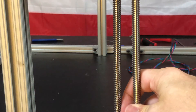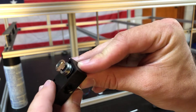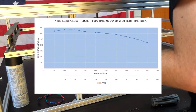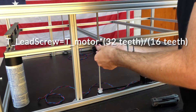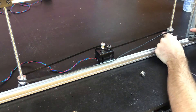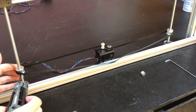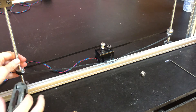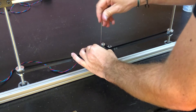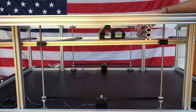I got these replacement lead screws which have a 2mm lead instead of the 8mm lead from the old ones. They also come with these anti-backlash T-nuts, which conveniently have mounting holes on the sides. This will translate to a much higher force, and we can actually calculate the theoretical maximum force of the bed using the motor curve, the gear ratio of the pulleys, and this one equation. I won't bore you with all the math, but this works out to a theoretical lifting force of 314 pounds. I say theoretical because there's a lot of assumptions in this calculation, and just because the motors can handle this doesn't mean the bed won't break under this load. Still, this should give us plenty of lifting force on the bed, which is important for the CNC's functionality because while most CNCs work by lowering the spindle towards the bed, this machine will be raising the bed up towards the spindle. Installing these lead screws was much easier, and after everything was aligned and leveled, it felt much better.